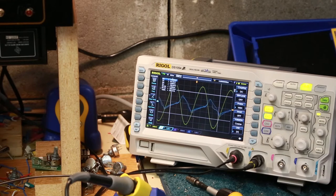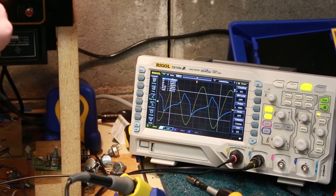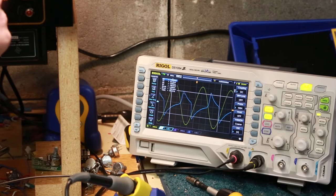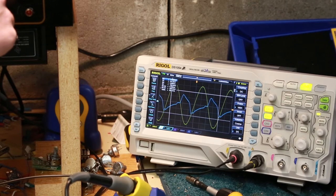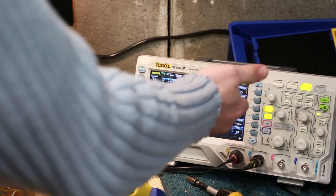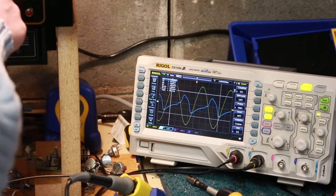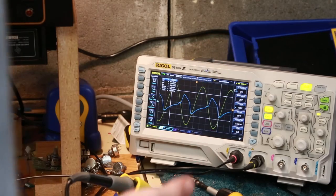Let me turn the reverb all the way off again. We've got our treble and our bass here, so I'm gonna bring those about to midway, and they are shaping the tone a bit, as you can see. But as I bring the volume up, we start hitting distortion, so bring it back down. There's definitely some oddness going on there. I'm not sure, I'll have to plug that in, but we are getting output. It is changing the shape a bit, so it's possible that we have something not done well, but we are happily enough at least getting input or output.